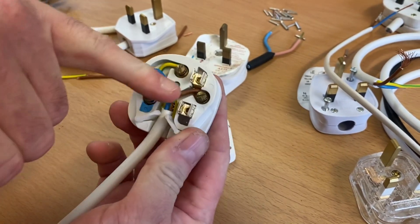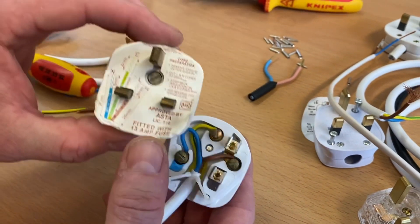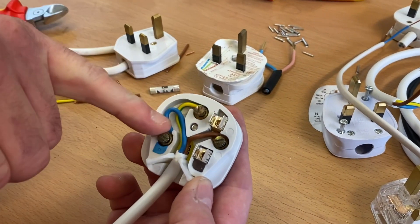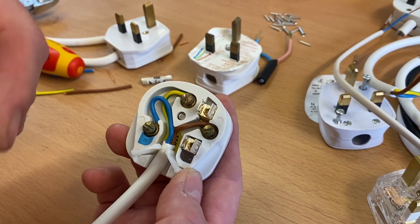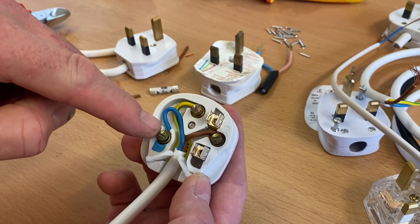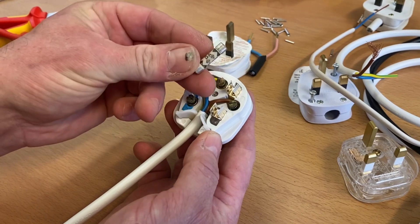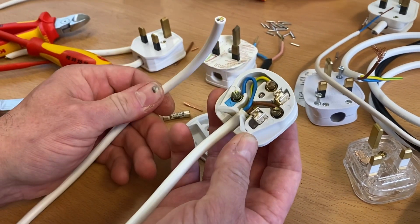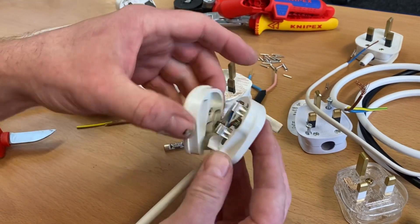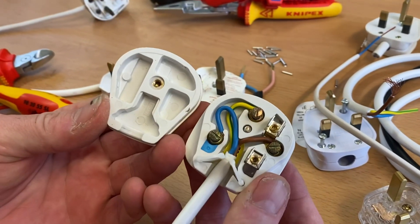I've laid the plug top out - line connection where the fuse sits, neutral connection, and earth connection are all made off with this MK style plug top. Remember you could use the conductor length lines printed on the cardboard, but at college you likely won't have it. The trick is not to lose any fine strands and to make sure terminations are tight, screwing into copper not into the PVC. At this stage I tell students not to put the fuse back in - if the fuse is inserted someone could push it into a socket outlet in the workshop, which would be dangerous. Bring it to me first for inspection.